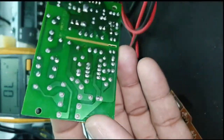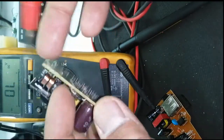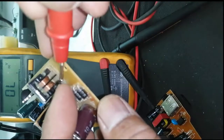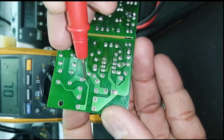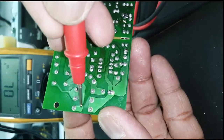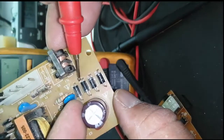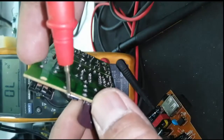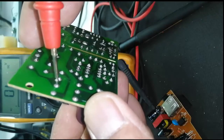If I come here, this is the AC input terminal. We see this inductor filter coil. From the filter coil, one line goes here and the second line of the coil is here. These are the two input terminals. The center two diodes are connected together on one side, and the outer two diodes are connected together — from here to here. The center diodes are connected here.